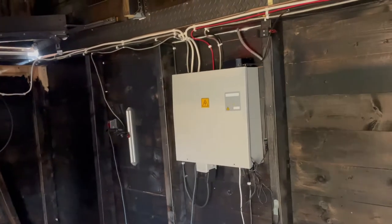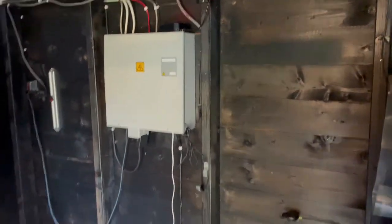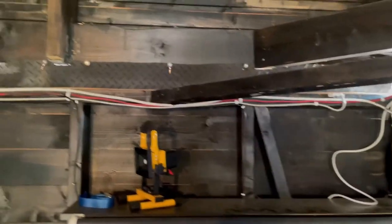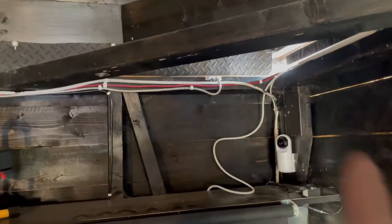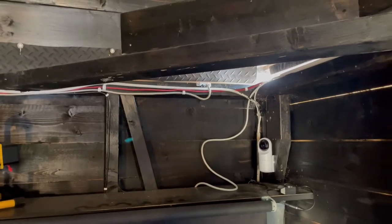The control board is a Lesedi dome board — it's about 50 euros and you connect it via USB to the computer, somewhere in that box there. To be able to open the roof a couple of inches more — about 10 centimeters — I need to move that sensor a bit further to the right. Let's do that.